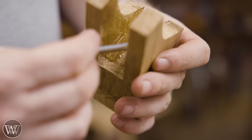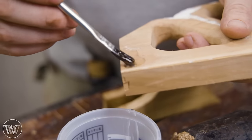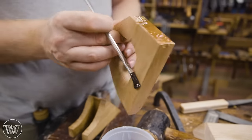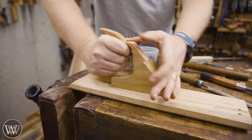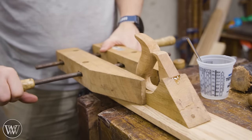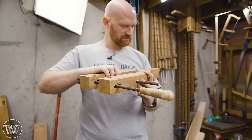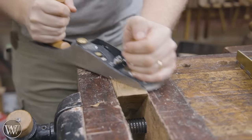I'm going to be using epoxy for this. The whole thing is going to be glued together with epoxy when I get to the infill, so make sure you get a copious amount on all surfaces and then slide it down into place. This doesn't need a huge amount of clamping pressure, but I want to make sure it doesn't move around. I also want to make sure the bottom is all flush and the epoxy squeezes out all the way to the bottom into that joint. We put one clamp on, squeeze it up, set it aside, then come back and smooth out all the joints.